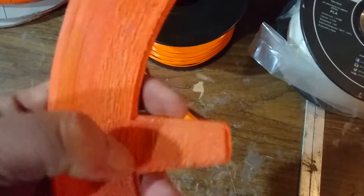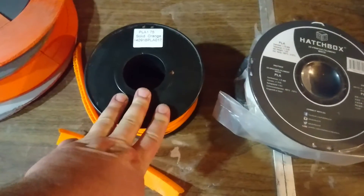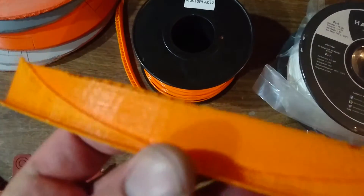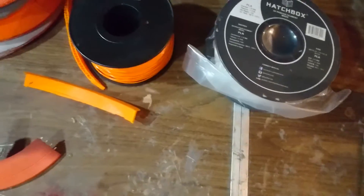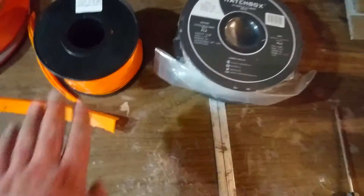If you push on it, it's got the same amount of infill and same skin thickness, and this is pretty good. This has water in it, and in a second I'll show you why I know that - not only because of the way the skin comes out on the outside, but it also clogged my printer. So now I've got to go through and clean the nozzle, the hot end, everything else.